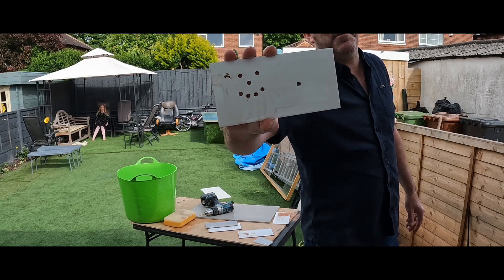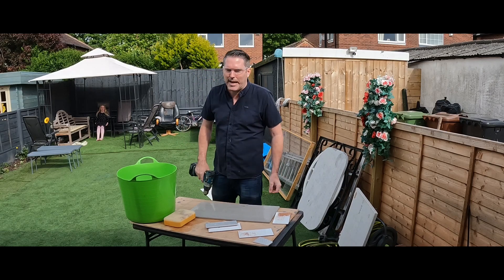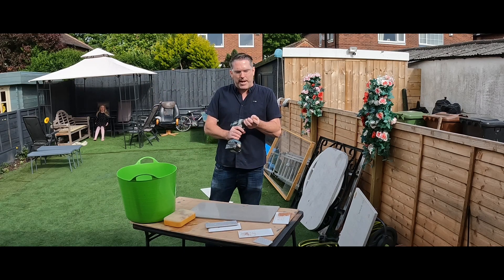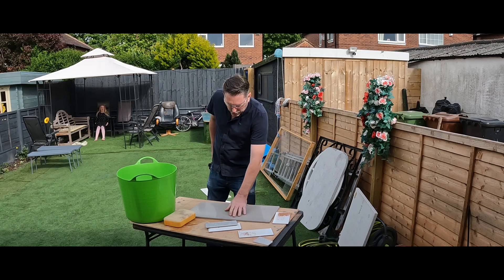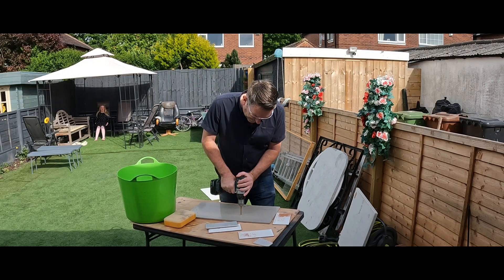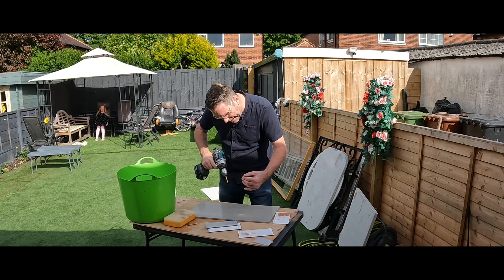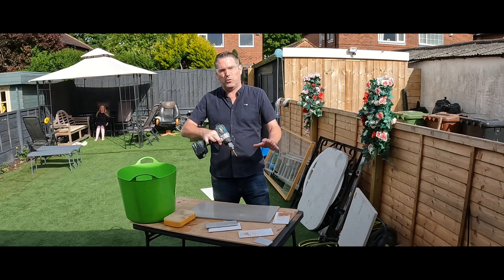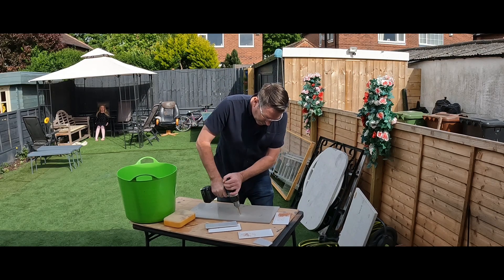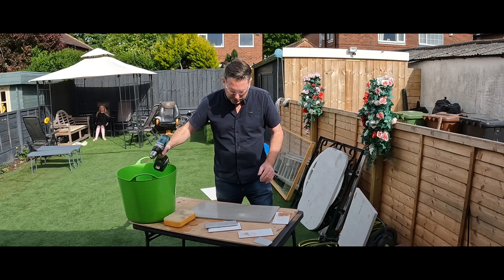They're the best on the market. I won't use a used bit again for porcelain because it's just not going to work — we'll get a new bit. This is where you can snap the ends off, because this is the textured surface of porcelain — the hardest porcelain known to man. Keep wobbling it. With this you wobble it more because you need to get the texture off the surface first. And you have to keep it wet, otherwise you'll go through the bits.